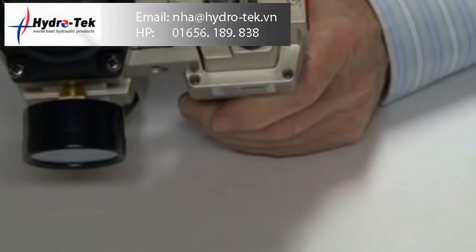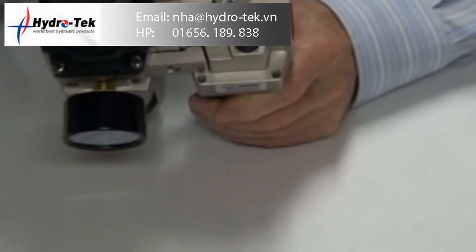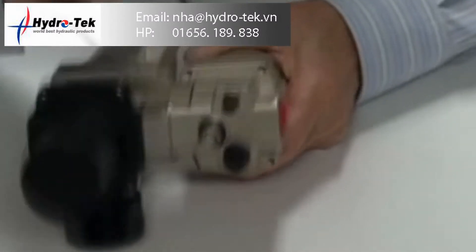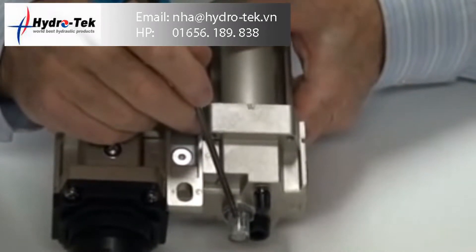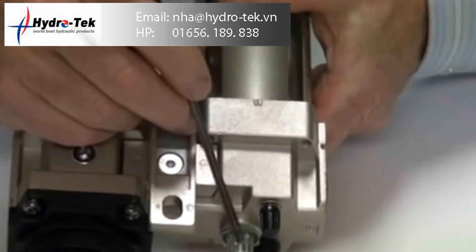For the filling point, put your general purpose airline oil — ISO standard airline oil — into here. By turning it counterclockwise to the plus, we increase the flow of oil; the other way to the minus, it decreases. We're looking for basically one drop of oil to peer and drop off every minute approximately.